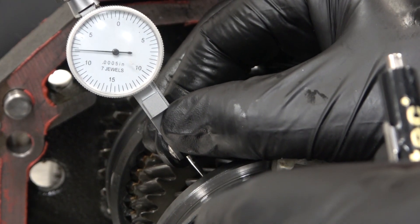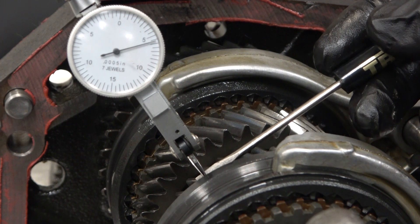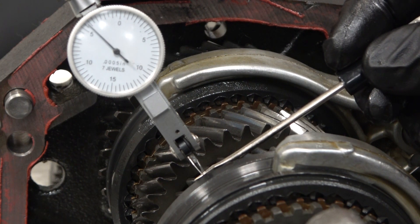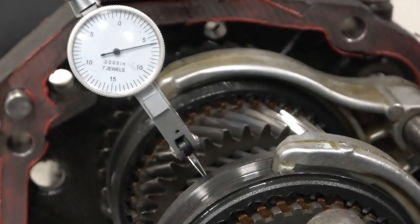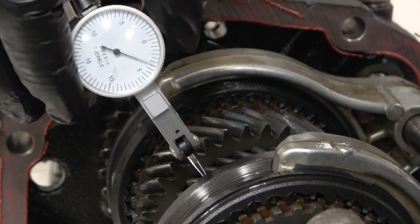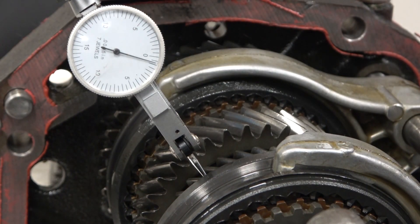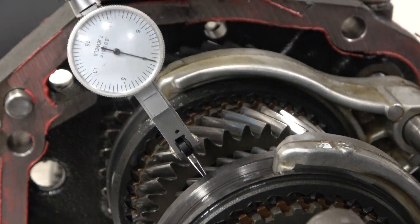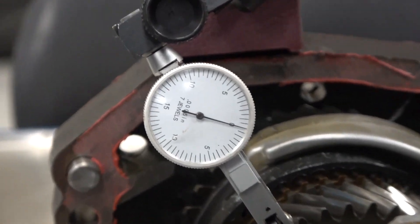If I push back gently — now I'm going to check to make sure it doesn't move one way, which would mean it's not touching the gear, and then check the other way. You can see how much more movement I have now — that's going to give me the full range of movement. Then I can go ahead and zero it. This is a very sensitive dial indicator, and the notation is important for how the dial reads.